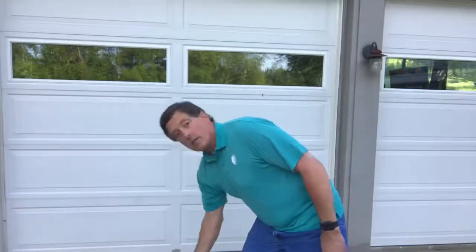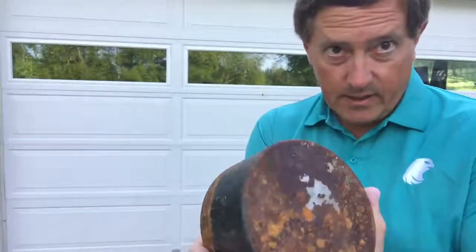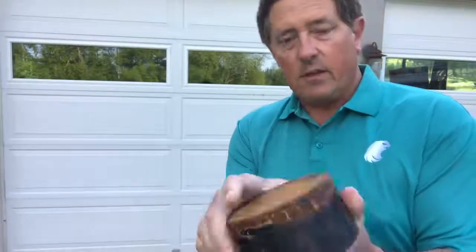I had the feeling that my last few videos filmed inside were kind of boring, so I'm going to do a really exciting topic today: surface preparation. Surface preparation is very important because hardness testing is a surface-based test. The indenter is going down into the metal, and anything that's in between the metal and the indenter is going to affect the reading. I took an old used-up test block — don't use your test block like this — but I left it outside so it's got a little rusty. I can't test on this because I'd be testing the rust.